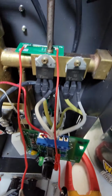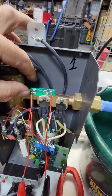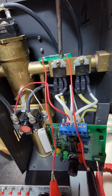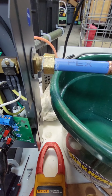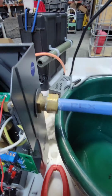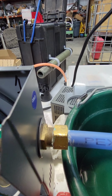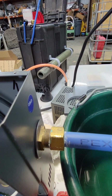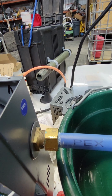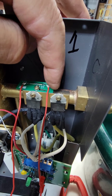Okay, so what I did here, I adjusted this little board and I slid this. I'll do it right now. Loosen it up here a little bit. There we go. And as I slide this board, I've got to loosen a little bit more here. There we go. If I slide this board to the right, you see the ohm meter is telling me that the relay has closed. So I believe what I said earlier, I was wrong. When the relay closes, the water heater starts as I'm moving closer to the magnet. Remember I said the magnet is in this area right here.